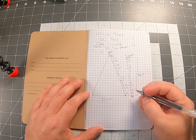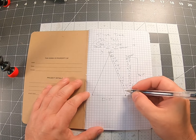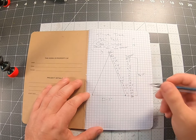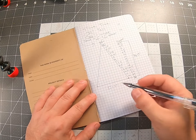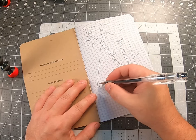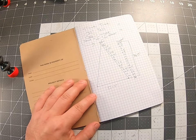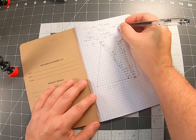The key to a project like this is planning. The first thing I did was figure out what shape I wanted for my tree. My main constraint was I couldn't be more than 36 inches tall and I wanted to be around 26 inches wide. I used the 26 inches wide with a decrease of 25% on each vertical stave, and that's how I came up with the shape of the triangle for my tree.